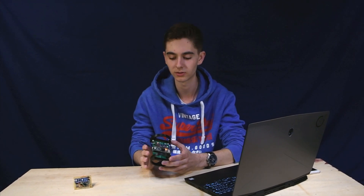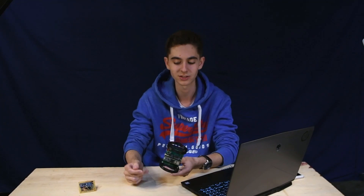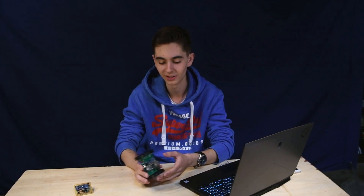It's running through all the orientation data, getting that and converting it to servo outputs. When we arm the flight computer, if it detects liftoff and pitches over, you can hear a high-pitched noise — that means not good, the rocket's not doing rocket things. Everything shuts down: it closes the SD card, logs the last bits of data it can, and then it's basically done. Hopefully your rocket has survived, but maybe it hasn't — that's why it aborted, because it crashed or was crashing.